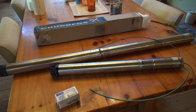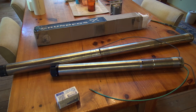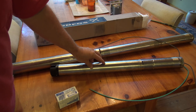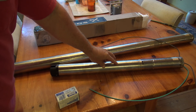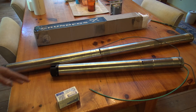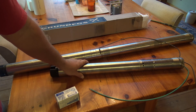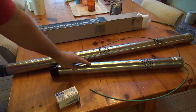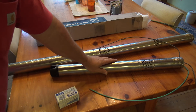That soft start is very forgiving to your inverter. So if you have a 115 volt inverter and haven't invested in a larger split-phase inverter like an Outback Radian, Magnum, PAE, or Schneider Electric, this pump is an awesome solution for those cheaper inverters. It will run on modified sine wave — I'm a little nervous to say that, but it will. If you can, pay a little bit extra and get a pure sine wave inverter. This pump has a capability of over 200 feet total dynamic head, so in most shallow wells and spring cisterns you can run a 30/50 pressure switch on your system and it works great.